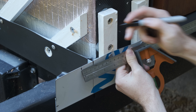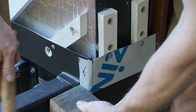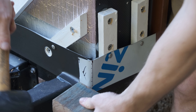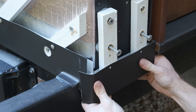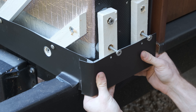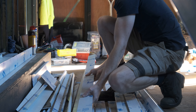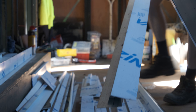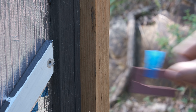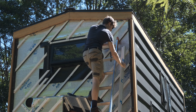I was having a little trouble figuring out how to integrate the side bits but found screwing them into place to get the bend perfect was the way to go. I decided to rivet the flashings together once I was happy with everything, though I did that a bit later off camera. Working from the bottom up and overlapping lets the water flow down off each piece without getting caught. As I finished the flashings for the bottom of the wall I moved on to the ones for the sides of the house.